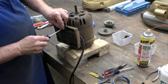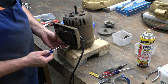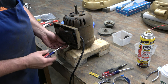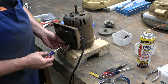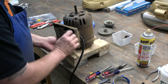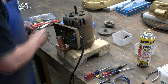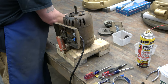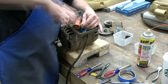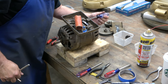Back in the day when these were made, they used a lot of paper and cardboard for insulation on the electrical components. The insulator that goes between the sardine can and this cover I'm removing is typically cardboard, and even that capacitor has a cardboard sleeve over it. Now I'm removing the terminals and letting the power cord fall away.